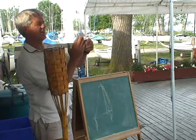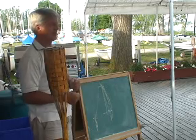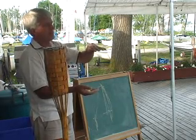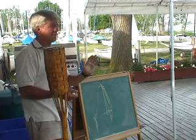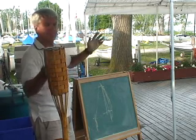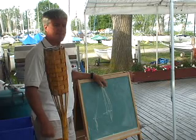When you use the sheet a lot, most of that bend will be more even, almost symmetrical all the way up. But when you use the vang, it drops that whole thing down a bit, and the top stays a little bit straighter because the bottom's sort of taking up that bend. This is a little technical, but I guess what you're saying is that when you're pulling on the main sheet, you're actually using the leech to pull down the top of the mast.